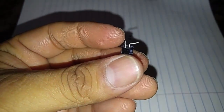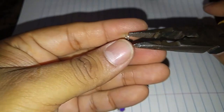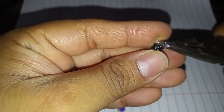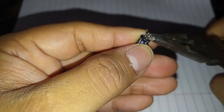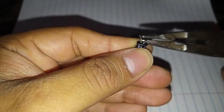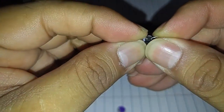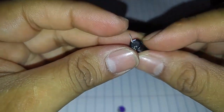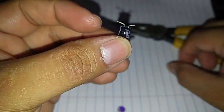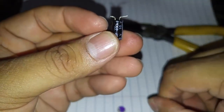Just like so, and then you bend the next one over just a little bit. Mine were already pre-cut because this is an old capacitor — just wanted to use it for demonstration purposes. You have to bend them back and make sure they're straight enough. Make sure that they have a little hook — that little hook is going to help you solder it into place.